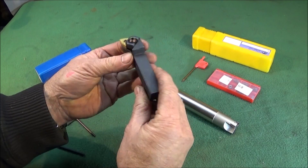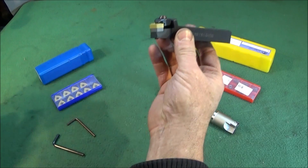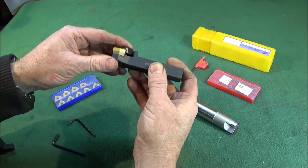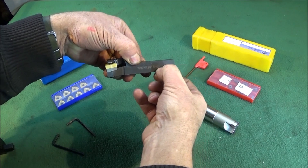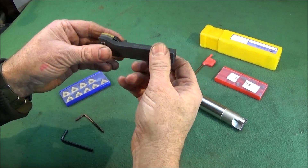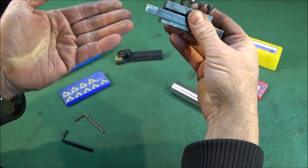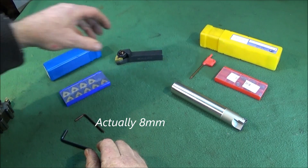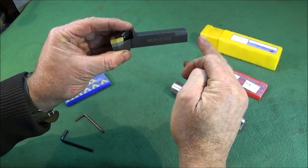I've bought this tool for use on my Chinese mini lathe and my Myford ML7. It's a 16mm square shank, so I obviously wouldn't be able to put that in my quick change tool post, and if I was able to I wouldn't be able to achieve center height on the Myford ML7. So I'm going to modify this tool by milling about five or six millimeters off the underside of the shank. When I first got my Myford ML7 I was quite surprised how small a shank you have to have on the turning side to achieve center height — milling the underside of the tool off is a great method for using larger shank tools.